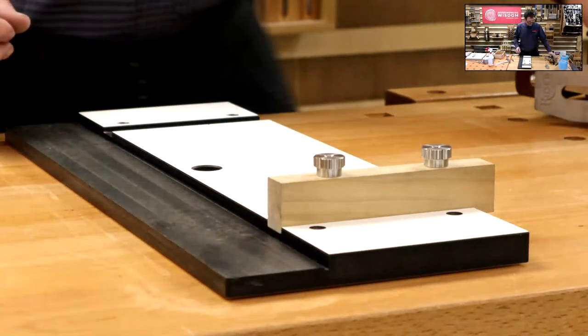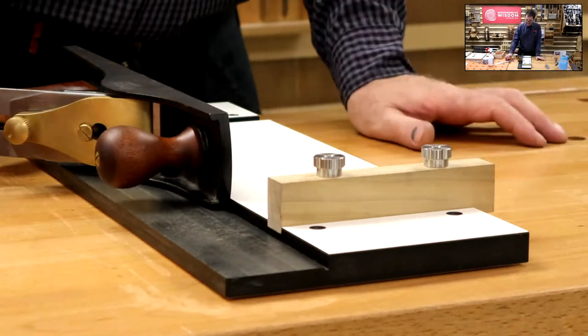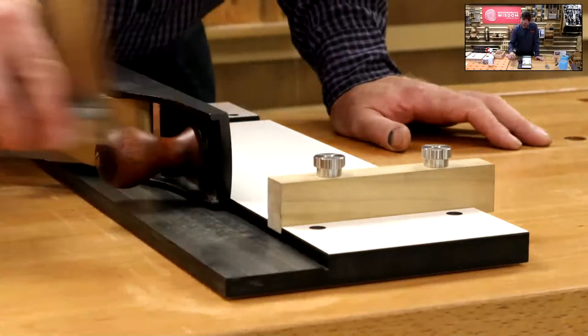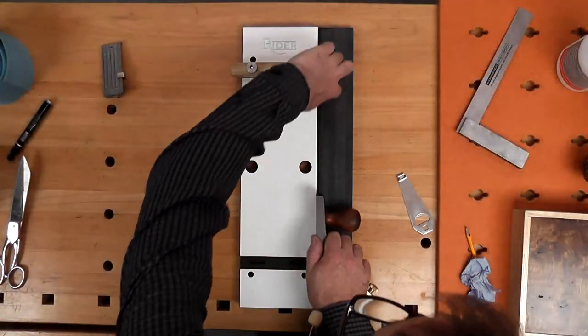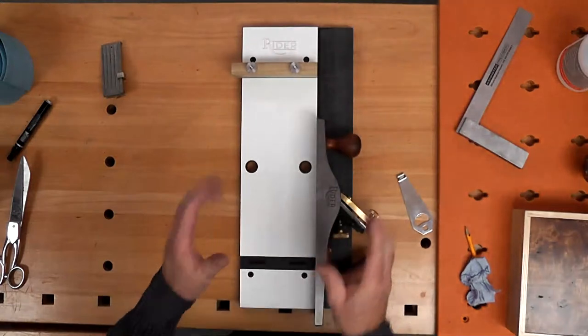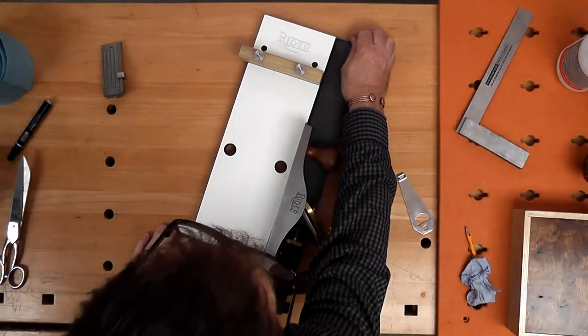All right. So next thing we've got, our plane. We can sit it on the side. Everything is accurately machined, so that'll be nice and square in that plane. We can come down. Now, first few strikes, I need nothing on here because we will take a minute little layer off the top edge of where this groove is because the blade sticks out that little bit. It overhangs. I'm just turning things around.